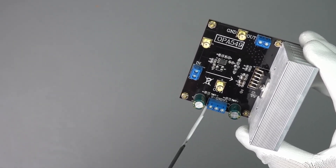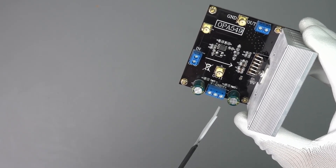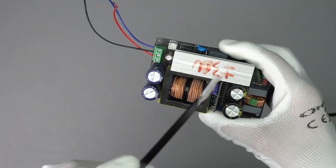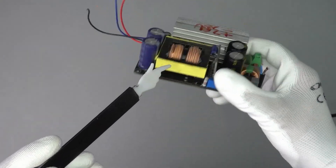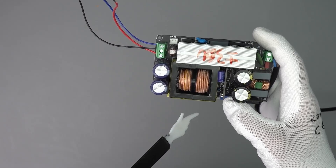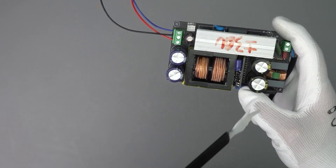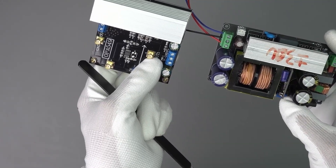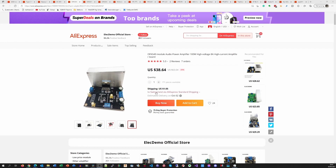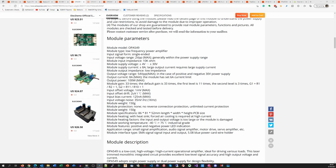As I said, you need quite a strong plus/minus power supply, which is very rare, but I found one with plus/minus 30 volts — written down by the manufacturer. It has much more power than needed. I did not find a more appropriate power supply, and in this case, bigger is better — you have enough capacitance to filter the ripple. These two boards in a nice case will be my power amplifier of the future. The output voltage range is 54 volts peak-to-peak if fed with plus/minus 30 volts, so you lose 6 volts. The output current is 8 ampere, but set to 6 ampere on this board.